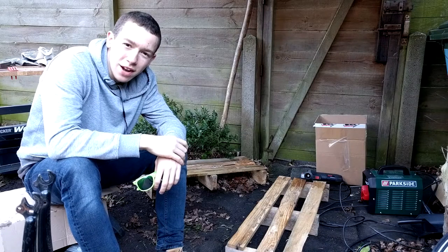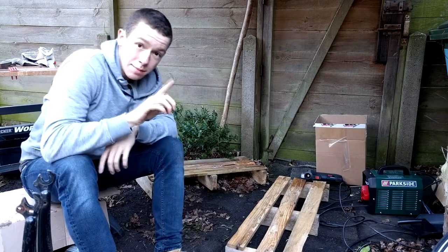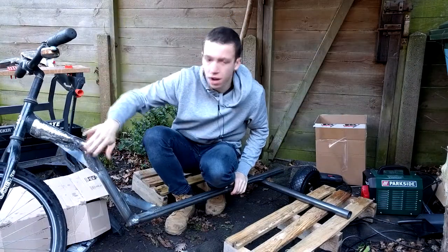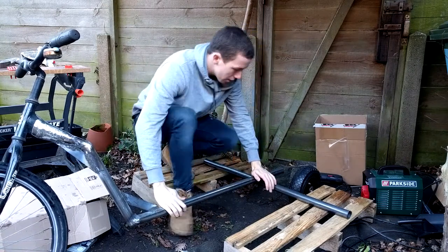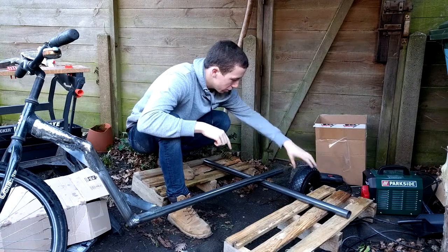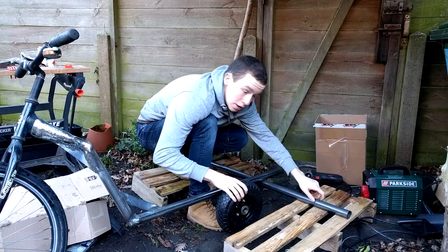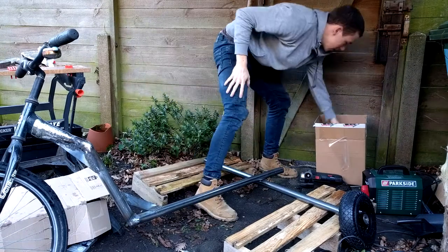Alright, since I've only been welding and grinding, I think it's time for a quick update so you know what the plan is. The basic setup looks like this — here I have my heavily welded and grinded piece, and here is my rear axle, or at least the tube that will hold the bolts that will be the rear axle for the wheels. These wheels have an inner diameter of 20 millimeters, so in here I will weld a bolt with 20mm thread. I can just slide the thing over and tighten it with a lock nut — on the other side as well.